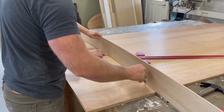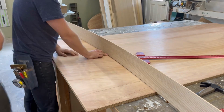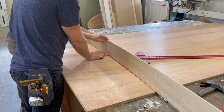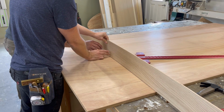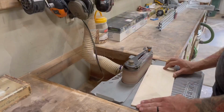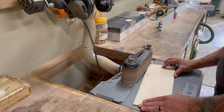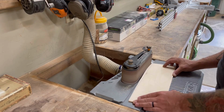They are great. The first thing we wanted to do was cut all of our ribs into individual pieces. Now we wanted to give them a little curve on the top, so I hammered in a few nails and we used those same pieces of 1/4-inch ply to trace out an arc on the top of our first rib. It's actually our transom.